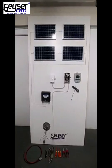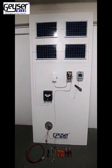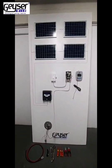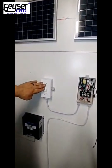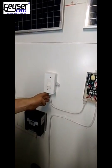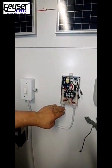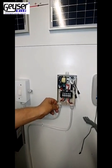This is an illustration of how to connect a GizaWise PV Water Heating System to a 200 Liter geyser using 4 PV panels. Firstly, ensure that the isolator switch is off, and mount the GizaWise Power Supply within arm's reach from the geyser. From the isolator, run a 2.5 millimeter Twin and Earth cable into the GizaWise Power Supply, and use the compression gland supplied.